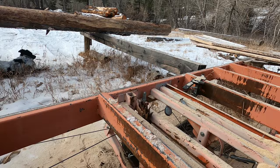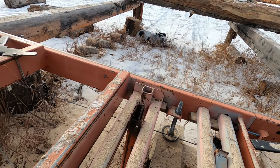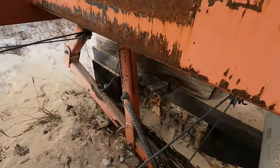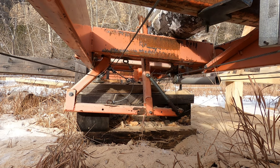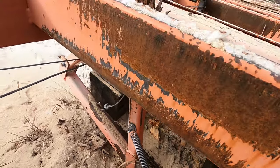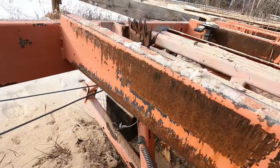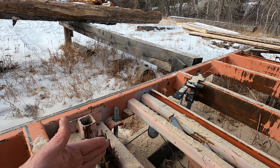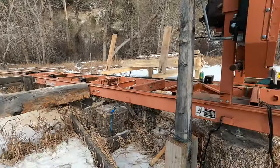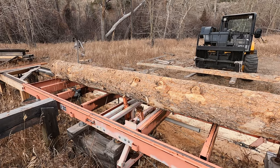Lastly, I built a powered log turner — it's a welded, homemade unit bolted in. A 12-volt winch pulls on a cable and raises one end of an arm that is hinged to a fixed point, and this portion of the turner is spring-loaded so as that part raises, the turner comes up. I also needed a way to position the turner head front to back, which is adjusted by pulling on the cable — I rigged up a simple handle so you can see how that turner head moves back and forth.